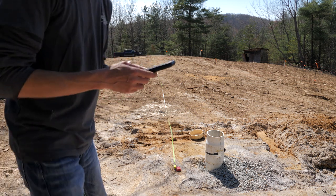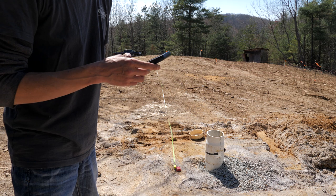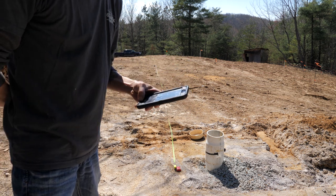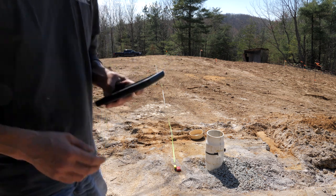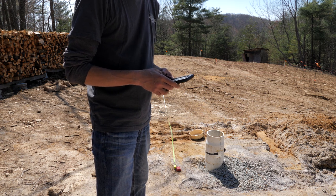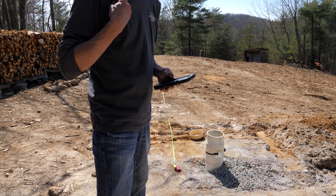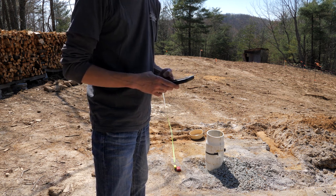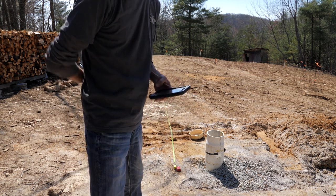Okay. Verdict is 191 feet times 2 minus 50, 332 feet. Whew, that's far. The well is 465 feet deep minus 332. That's 133 feet of water times 1.47, 195 and a half gallon reserve.